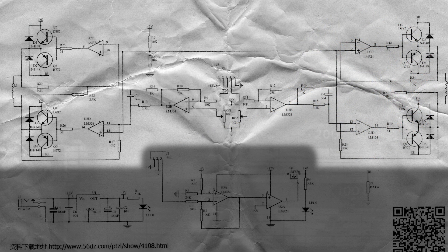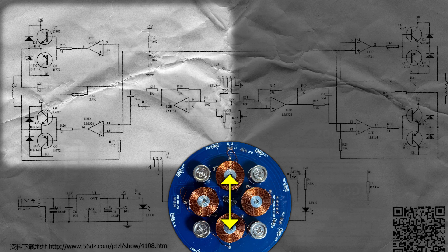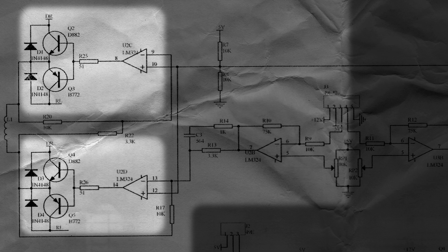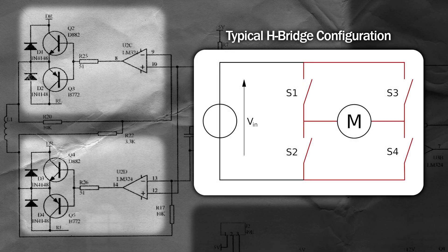If we look at the top half of the diagram, you'll notice it's almost symmetrical — and that's because it is. It's actually two separate control circuits: one controlling the Y axis and one controlling the X axis, so we only need to look at half of the diagram. Both halves are set up as power amplifiers, each used to drive the two ends of the electromagnetic coils. What makes this arrangement special is it can allow the voltage on either side to range between 0 and 12 volts, meaning it can actually reverse the direction of the magnetic field and also control the strength. This kind of arrangement is typically used with motors and is called an H-bridge, and can be used to change the direction a motor is turning in. This allows the circuit to apply a magnetic force in each direction — X and Y — of varying strength and direction, which is exactly what you would need to do to keep something perfectly still.